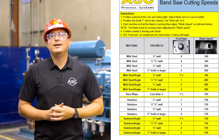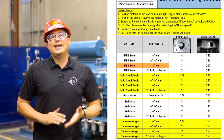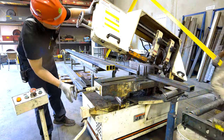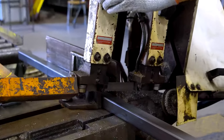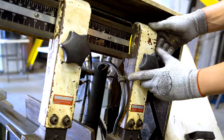For example, if we're going to be cutting a one-half inch mild steel square tube, we would check the work aid and set the feed rate to three and the blade speed to 280. Once we have set the material in the vise and have it secured, we will set the blade guide support one inch from the edge of the material and the inner blade guide on the yellow line indicated here.